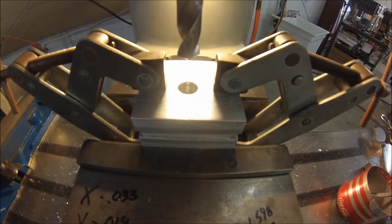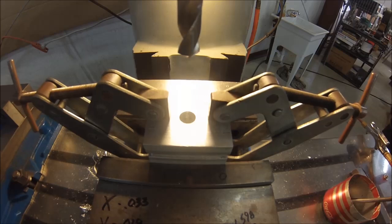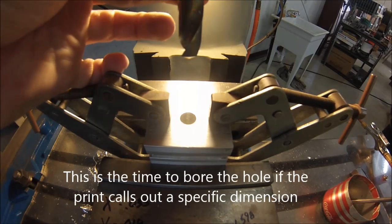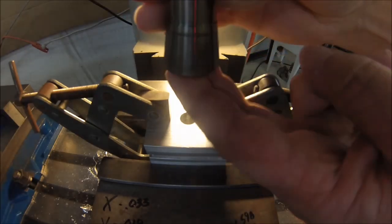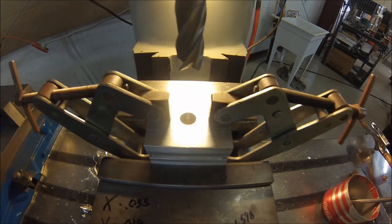That is a half-inch diameter hole and it goes all the way through. It's not the finish size I want, so I'm going to take the drill out and put an end mill in and plunge that down through the half-inch pilot hole. Now I know a lot of you guys just saw me put a four-flute end mill in on a piece of aluminum and you're scratching your head saying why. But my two-flute five-eighths is currently set up in my CNC mill, so we're going to have to make do with a four-flute. Please forgive me — I don't usually use four-flute on material like this.